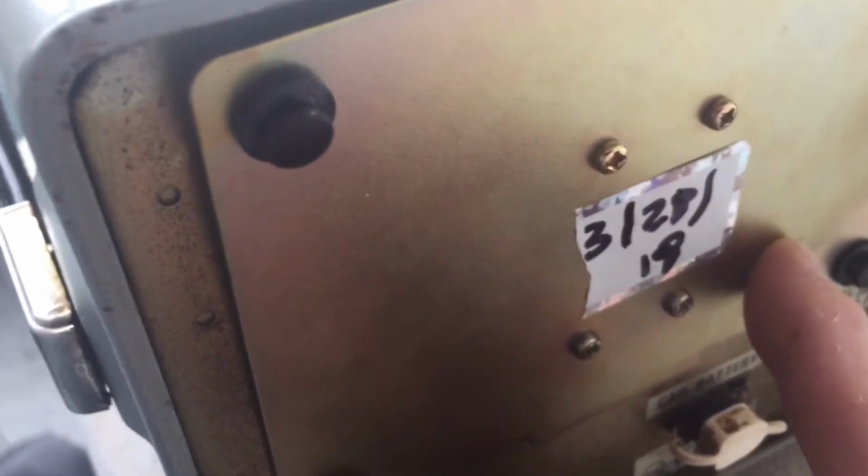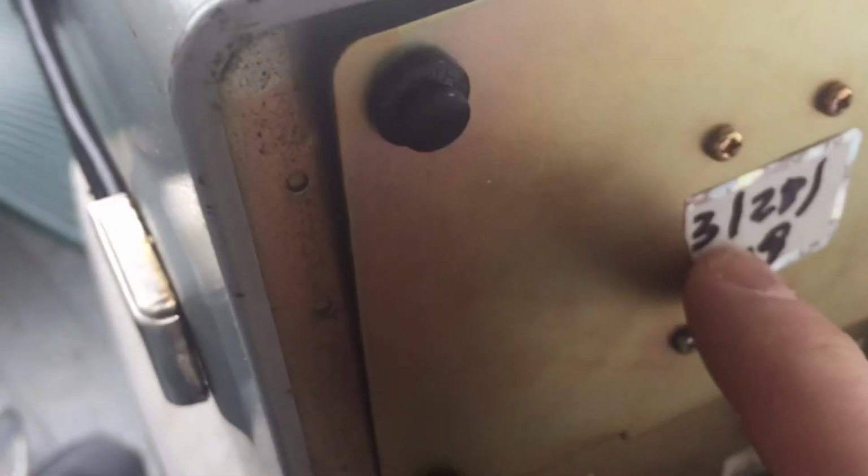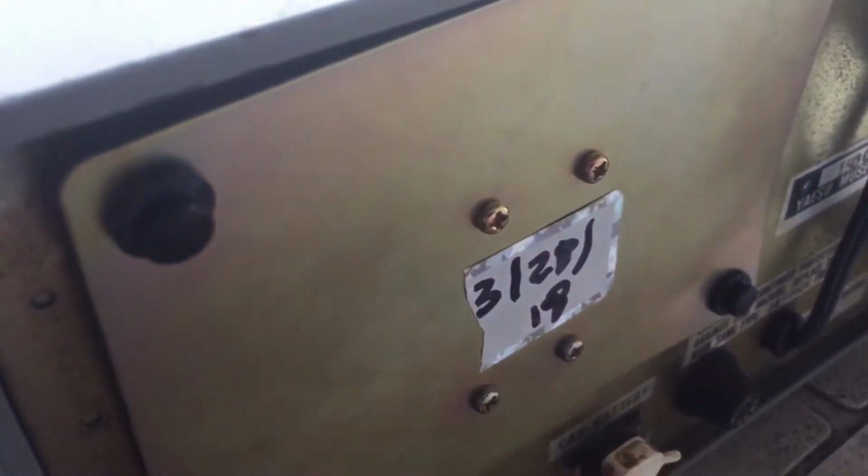With regards to the battery conundrum with these radios, don't be afraid of running it off of DC current. Just put a little tag right on here with the date. This is what I do with my Zenith Transoceanics. Just keep an eye on it. It's not a ticking time bomb. Use good batteries in it. I put 8 Duracells in there. They're not going to blow up.